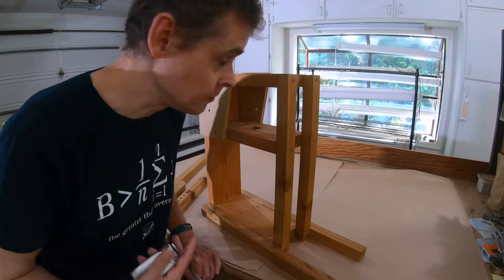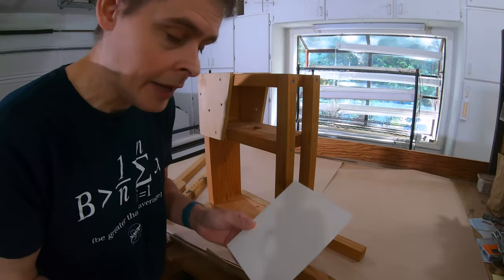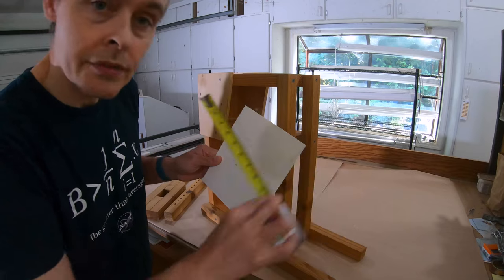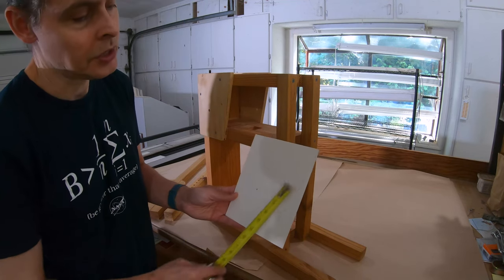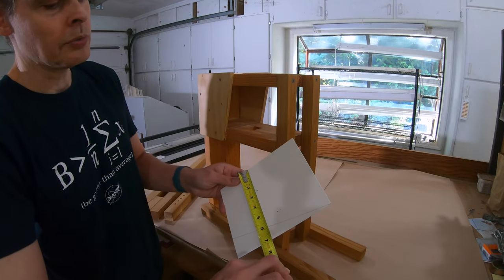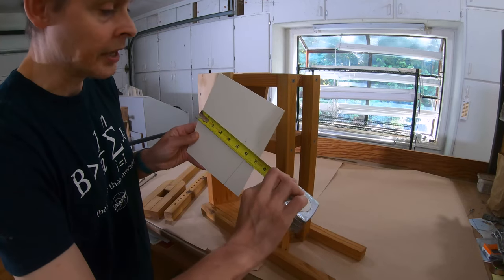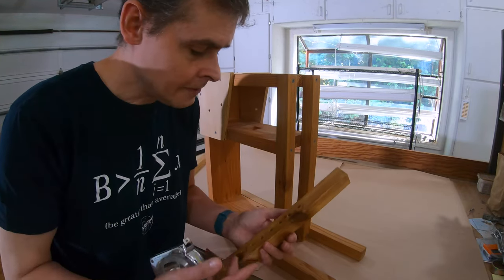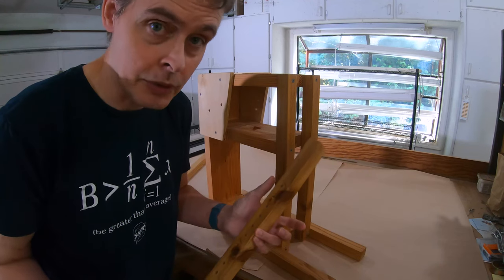Let's start with the parts that I get the most questions about. These plywood supports are pretty easy to make. You just start with squares of plywood — it doesn't have to be too thick, it just needs to be sturdy. 8 and a quarter inches tall by 7 inches wide. This dimension is 5 and a quarter, so you would just cut your angle right along there. The two pin positions are: 2 and a quarter from the left, 4 and three quarters down; and 5 and a quarter from the left, 3 and three quarters down. The original directions weren't super clear about exactly how many or where to put the holes, so I just did a whole bunch so we'd have a lot of flexibility to work with.